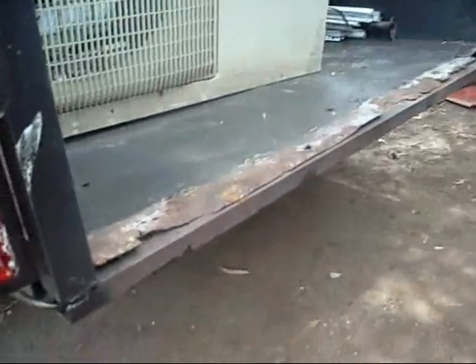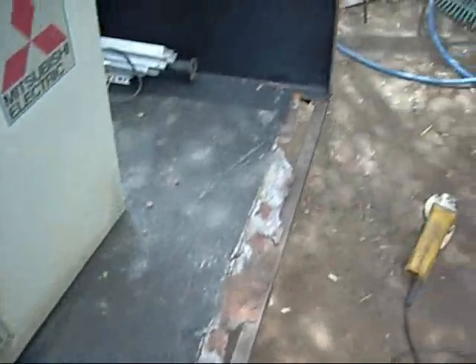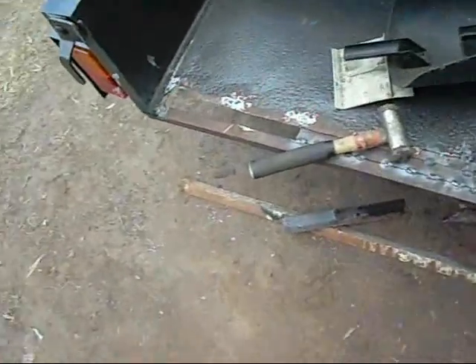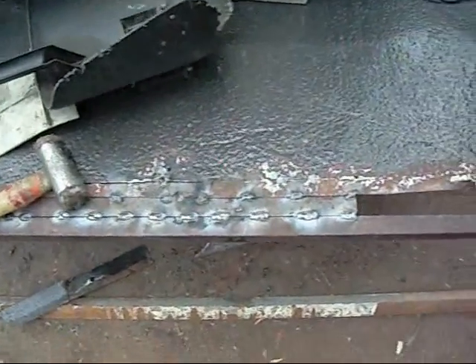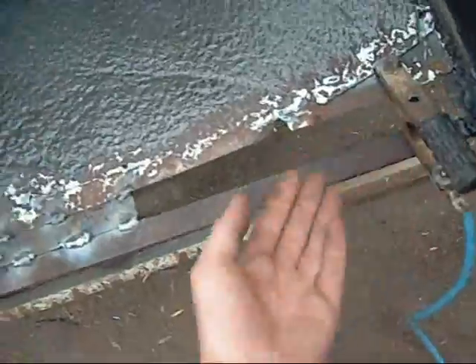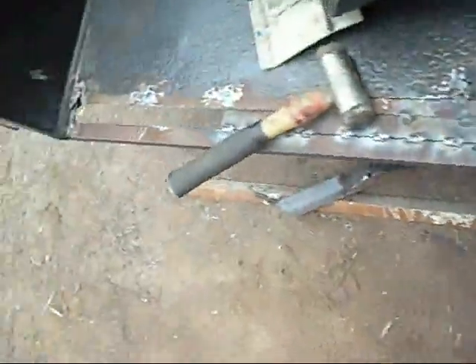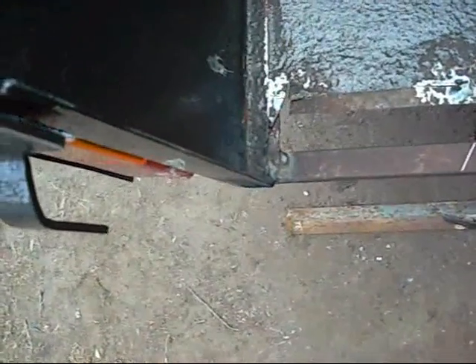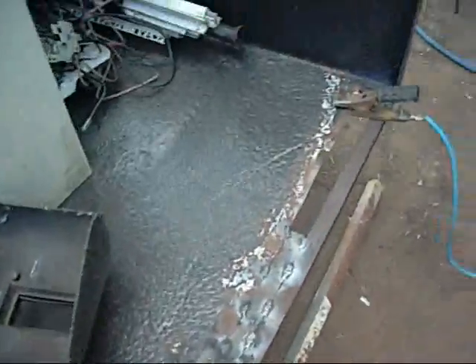Oh well — good thing I've got lots of tube scrap and other crap. I'll just cut some lengths of old steel tube and weld them in. Well, admittedly this isn't my best work but it's a damn sight better than the person who botched it up for a quick eBay sale. All I'm going to be doing is tacking all along here, beat it down, tack it. I've got some more off-cuts of steel to fill in underneath it. I've actually welded this bar on properly because it was barely hanging in there — definitely not worthy of hanging a tailgate off, but this bar will stay put now. There are angle iron chassis rails running down the length of it so I can weld into them. I've just got to cut this out, grind all that back again and lay another weld over it, but it should end up alright.